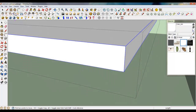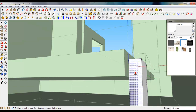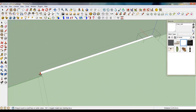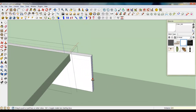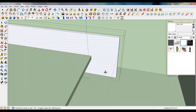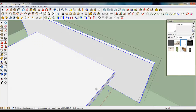Also create a back of the bed. It's simple. Make a group also. Extrude it by 32 millimeters. Push it to the floor and to the edges of the board. When it's done, let's push it again by 400 on the sides and 400 to the top also. Well, not 400 but 350. And we have a back also. We will add some details and round corners later.